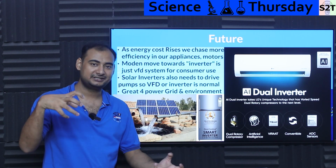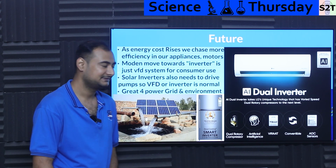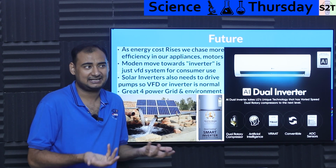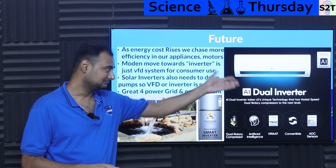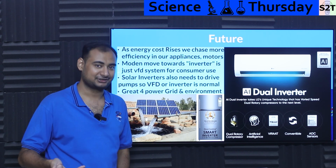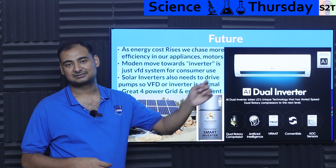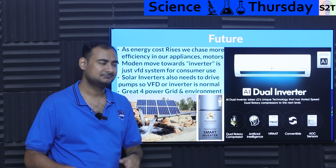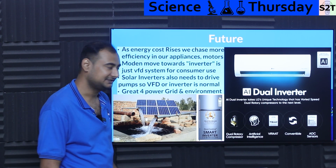By design, if you open it up and compare the schematics, it will be a VFD schematic. It may have some parts removed. VFD is a flexible device, so an inverter may be a cut-down VFD, where it's like, I only need these functions, rather than full ramp up, ramp down control circuitry and full this control, that control. Bare minimum. That could be true, but people have opened it up and it's like, bro, it's a normal VFD.